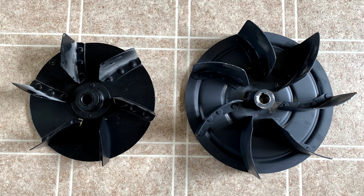And here's where we get our traditional visit from Murphy's Law. The larger impeller is a clear win when it comes to flow at the dust hose attached to the dust boot on the X-Carve spindle — that's 34% more flow, which is going to pick up a whole lot more dust. Unfortunately, looking at the motor spec as installed from the factory, the amperage draw in 120-volt mode is 12 amps.